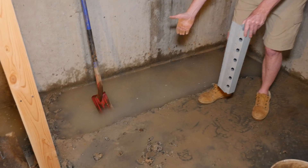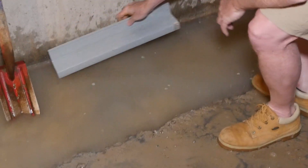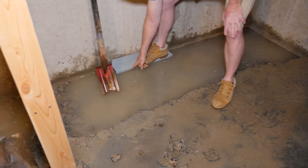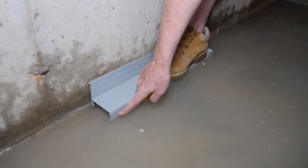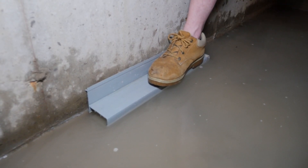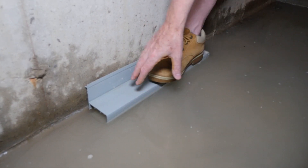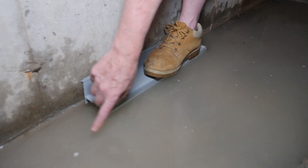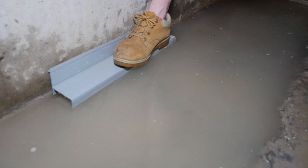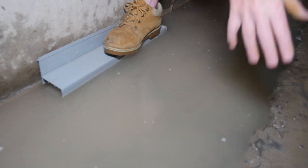This is really important because if the water is right here, that means the entire floor has water up against the bottom of it and the water is surrounding the entire floor. This is what I mean when I talk about where you manage your water determines just how dry you can get your basement. There's a particular type of system that sits right on top of the footing — so it would sit there and you can see the water fills up right next to it. So if the water level is here, the whole floor is sitting in water. Concrete is porous, it absorbs water, so your whole floor will always be damp because it'll have access to this water even though this is going to allow water to overflow into a sump basket and be pumped out away from the house.